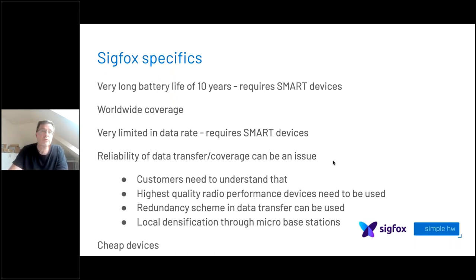One of the ways that we also overcome the data rate with our devices is that we are supporting sending only one frame instead of three frames. The other one is that we are supporting 600 bits per second encoding in RC1, so we can send basically 18 times more data, or 18 times more messages, than with regular devices.